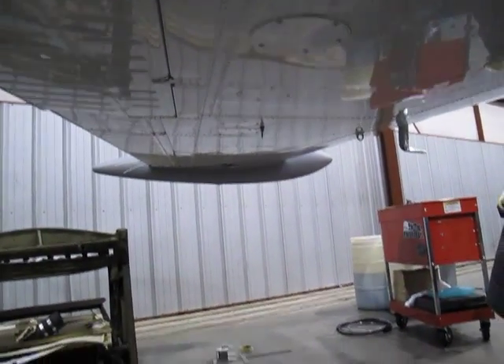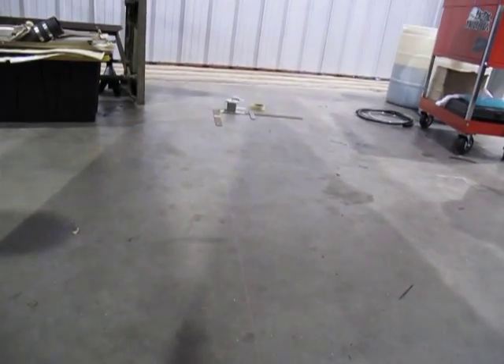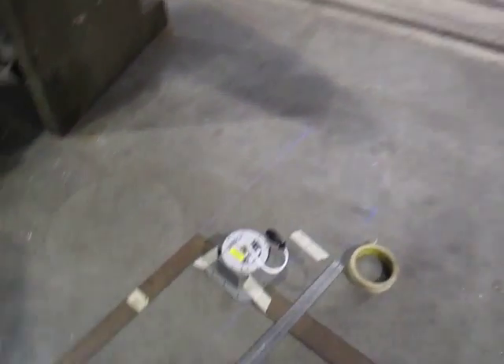The airplane is jacked level in pitch and roll. We also did a plumb line from the underside of the rib that the magnetometer mounts up against — or the bracket does. So we made a line, squared off that, and extended our square line with a laser line out here, and then we measure the distance of this angle here, or this line here.